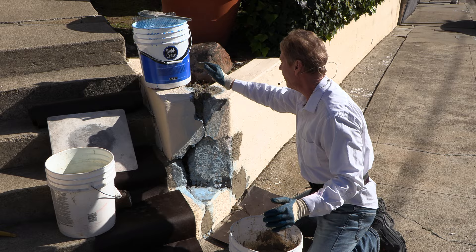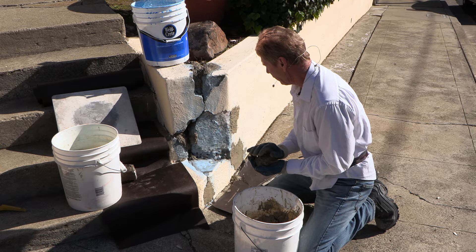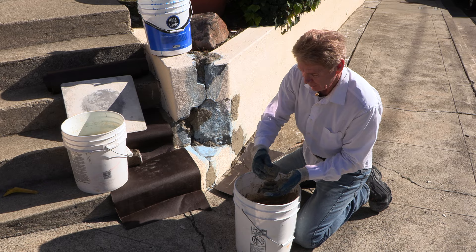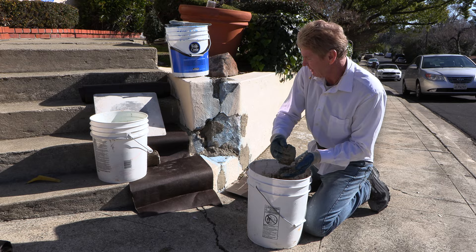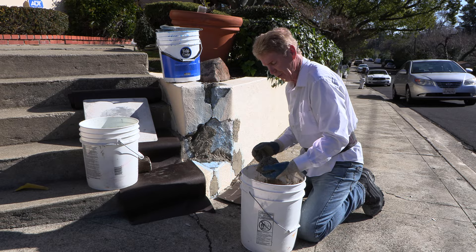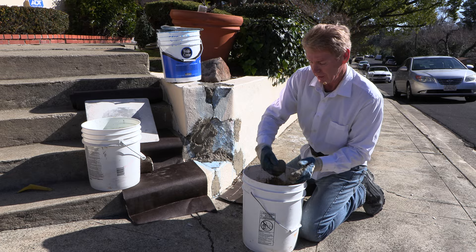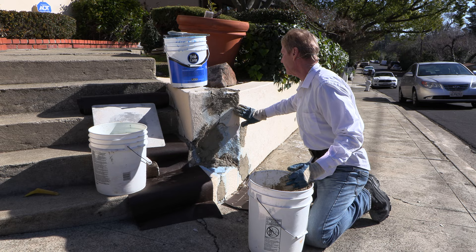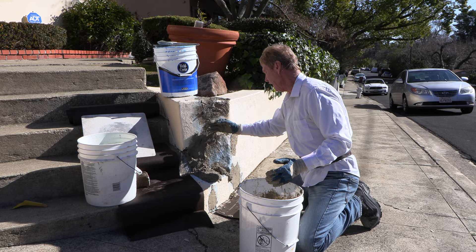You've got to have the right cement. Everybody's making same-day cements now — Rapid Set, sold at Home Depot and Lowe's, is actually a pretty good cement. When they say Rapid Set, that means it sets rapidly. I like something that sets in about five minutes. Normally you'd see me using a trowel to push this in, but just because I can, I'm using my hand with a glove — naturally, all stucco is not good for your skin, it's kind of harmful. This is going to get hard in about five minutes.